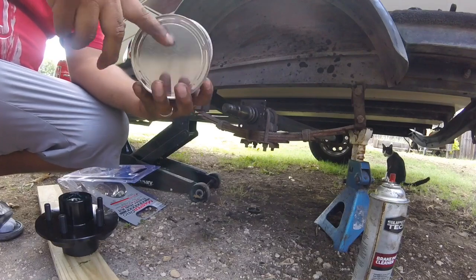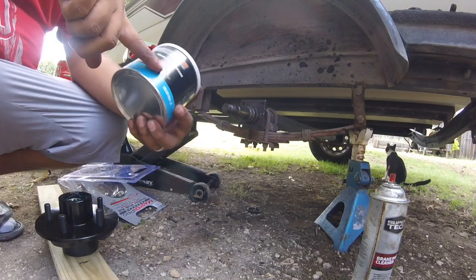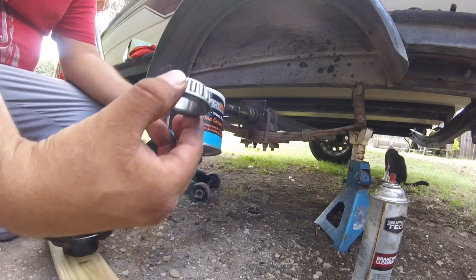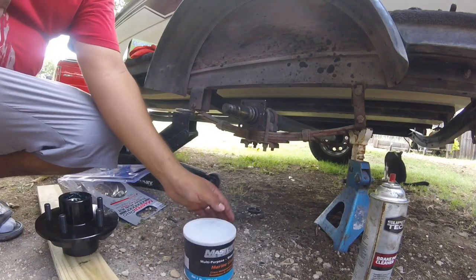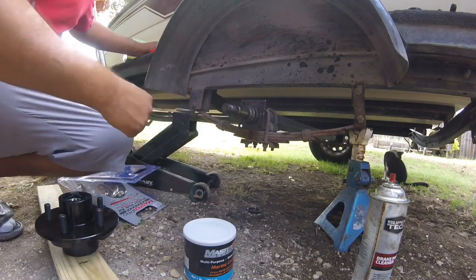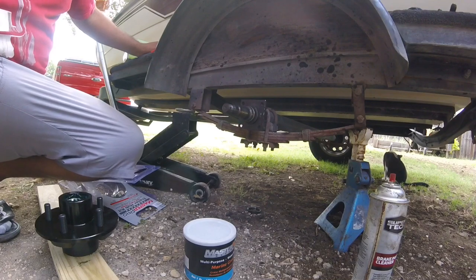I might do a little bit different though. I know your bearings are already packed with grease, but I went ahead and bought some master pro marine grease. I don't think it's going to hurt — I'm just going to pack some marine grease in with the other grease on the bearings. I'll wipe them down and repack with marine grease. I'll also put a little bit of marine grease on the shaft and sand it down a little bit to smooth some of the nicks and burrs.